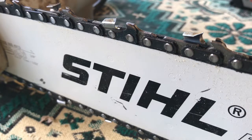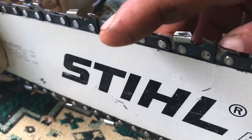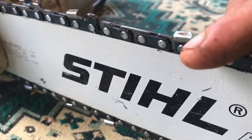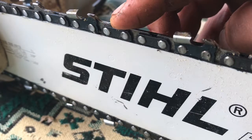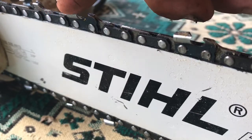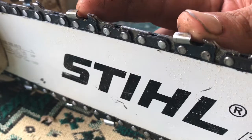Sharpening up the chain — so this is the link on the Stihl, and as you can see there's one tooth on this side, and the next tooth along is also on the same side. In the middle there's a blank section — that's the bit where they joined the chain together. It is a Stihl chain; I don't know if it's a standard feature on other chains, but that's how you know where to start and stop.